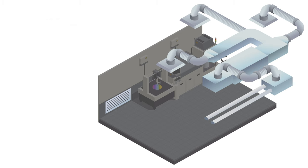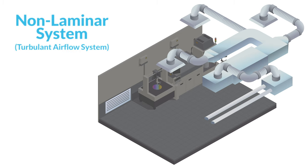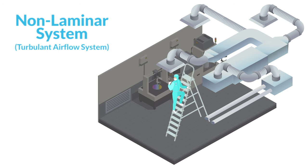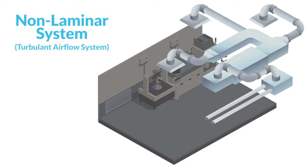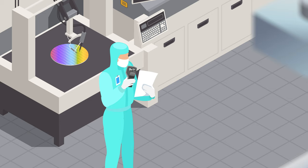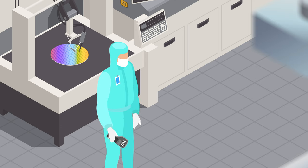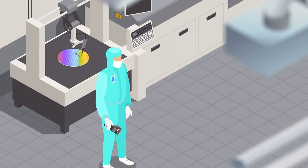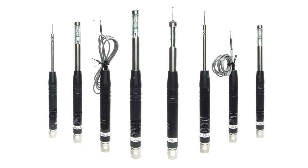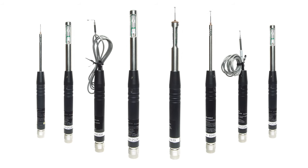The second common type of ventilation system is non-laminar or turbulent airflow. In this case the room is designed to dilute and remove contaminants based on a certain number of air exchange rates per hour. To check this type of system you would measure the airflow at both the supply and the returns and then calculate the number of air exchanges that occur per hour. After you've collected your data it's time to compare your results with the design specifications for the room. Measuring airflow can be tricky, especially when dealing with airflow that varies greatly across different parts of the system or room. This is why having multiple probes specialized for different conditions is crucial for making sure you get the best results on any job you take.